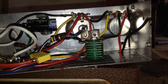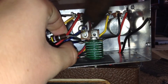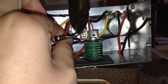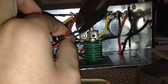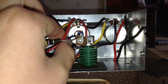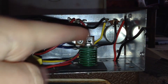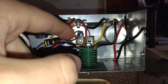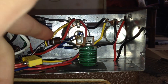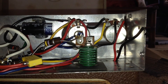To start replacing the selenium rectifier, I'm going to clip the little wire that goes to the actual rectifier, disconnecting the selenium rectifier from the rest of the circuit. Then I'll replace the selenium rectifier with the diode and the resistor, making sure that the cathode of the diode is facing the right way to give the B-plus voltage the correct polarity. I'll make a time-lapse of me changing it out.